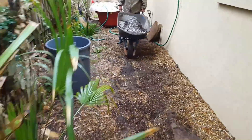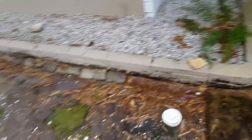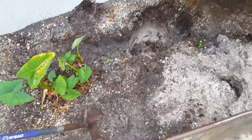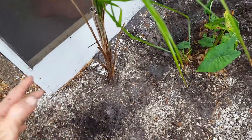Right up here by this clean out, we'll go ahead and put our first pile and then keep staggering them so we can easily grade this out. You can see we've got our sump pit already dug out and we're making the trench for the footer pipe. It's not really a footer pipe because this isn't a footer drain, but we'll call it that. This is our gravel perforated pipe, or the easy flow. We'll hook up that downspout — there was an old perforated pipe in here that we pulled out.